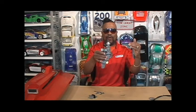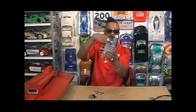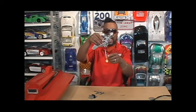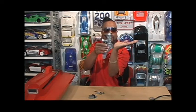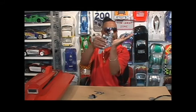So what you want is some flexibility and adjustment of this motor so you can rock it forth and aft, forward and backwards. If there are too many waves or high waves coming and you still want to sail this boat, you would pitch the prop down. The force of the energy forcing down on this angle will cause the back of the boat to go down and the front of the boat to rise. If it's this way, waves are coming over the top of the boat, and you don't want that. Pitch the motor down. Now the boat pitches up in the front and it hits the waves somewhere beneath the nose of the boat, and you've got more control. And so that's why you need an adjustable mount.